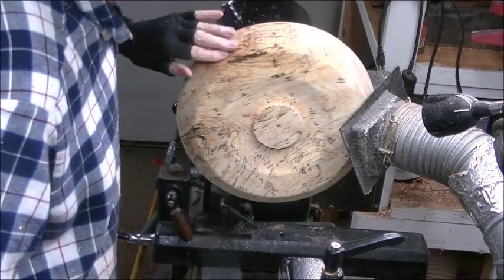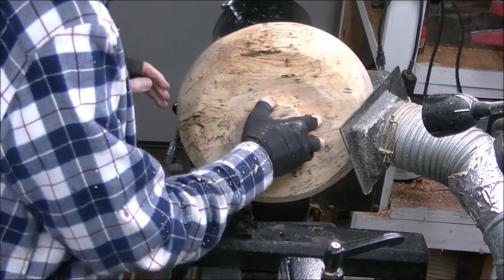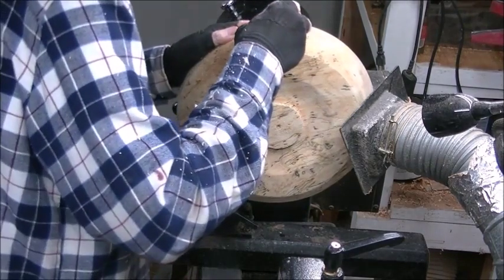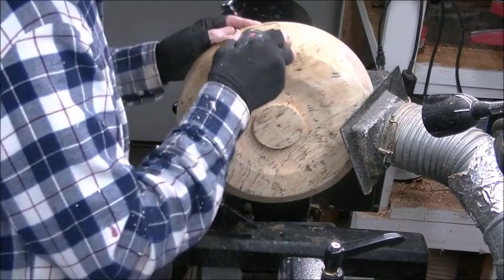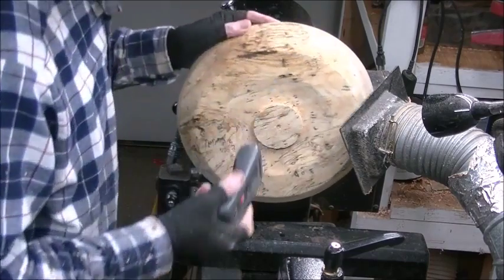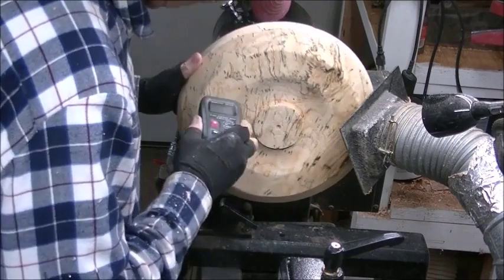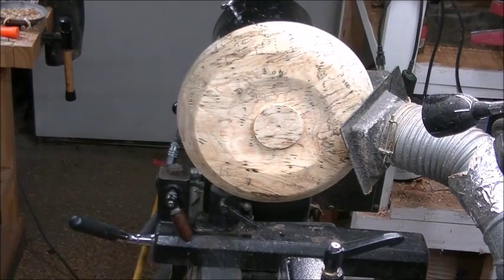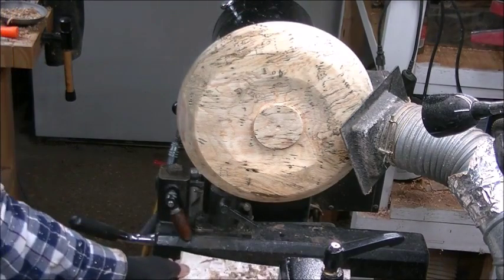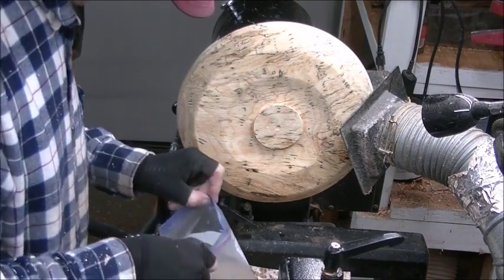Awful wet right there. That sort of bothers me. I mean, it's wet. About 63%. I mean, that's wet. Compare it to right here. That's 38, 47. Whole thing's pretty wet. Probably gonna warp like a big dog. And I may have to do all this over again, depending on how bad it works tonight.